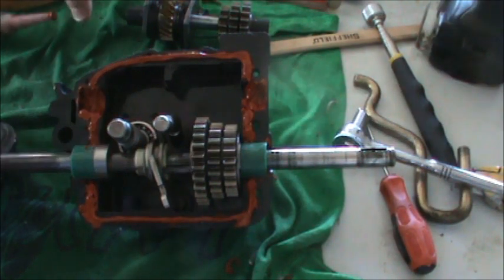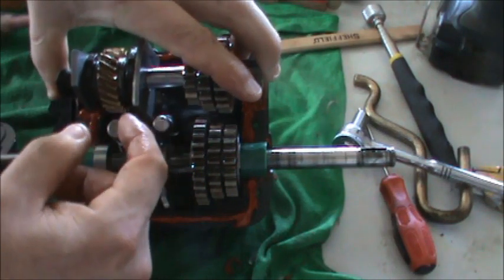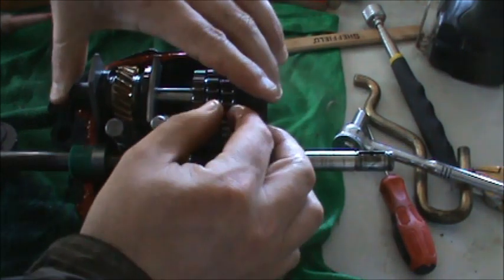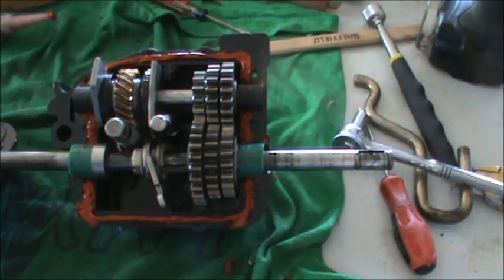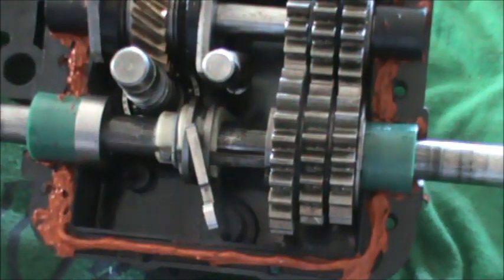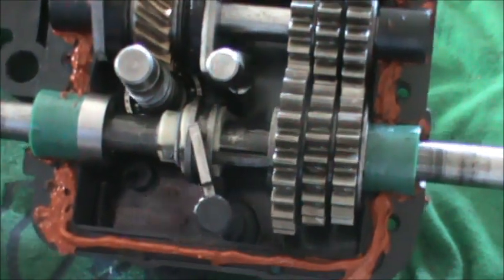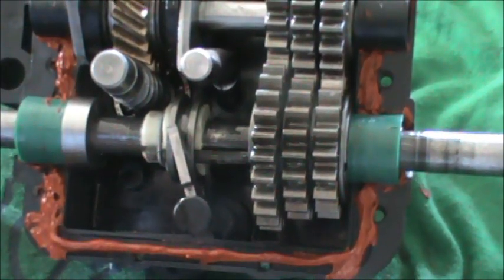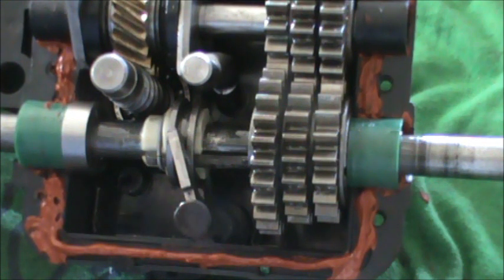We got everything in there the way we want it. Just going to pick this thing up and slip it in here. There we go — nice, perfect fit, and it's meshed very well with the worm gear. On top of here is a cap — I want to be sure not to forget that — and I'm going to run RTV around this top case. I have a fair amount on here, and I'm just going to do a lighter amount on this top and then try and get it attached.